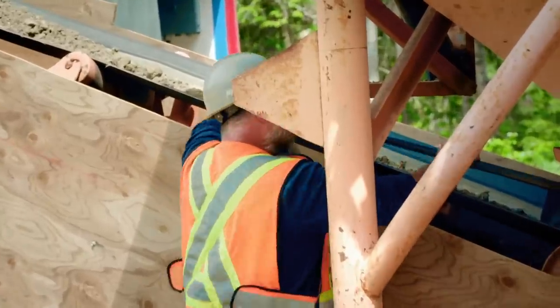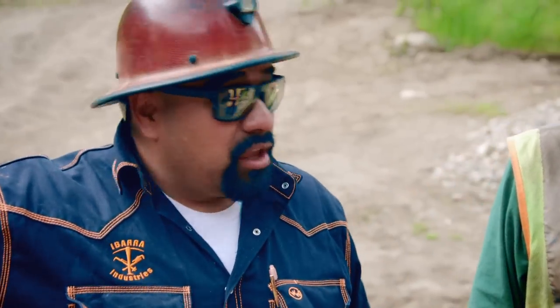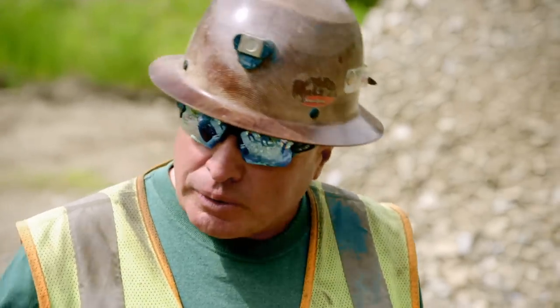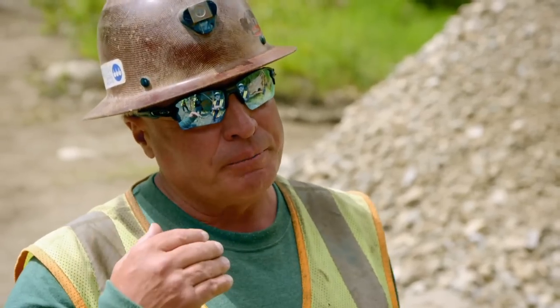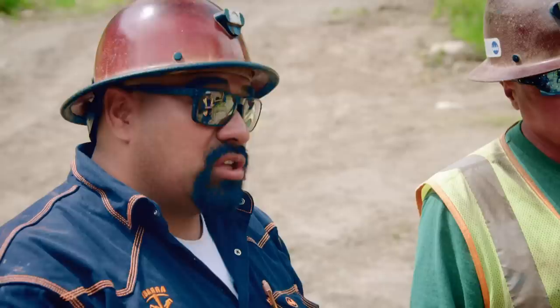Juan and myself put some ideas together. Starting with your grizzly — the way that you store your material, you leave it underneath the grizzly. The problem there is it gets just sopping wet. Our thoughts were: grizzly it, then windrow it out here so the wind and sun hit it, and then put it in your plant. The next one is obviously your hopper — we talked about putting a vibrator on top so it can help that material vibrate through. Next, we're going to eliminate your bowl and have it all go down one sluice and extend it out.